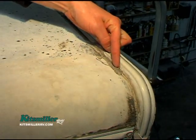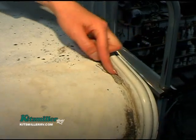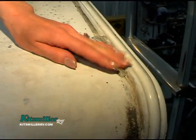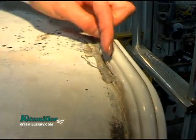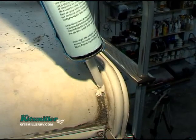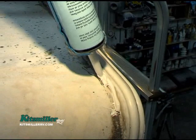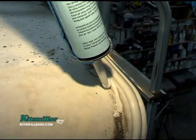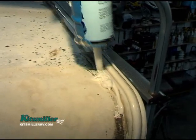We're going to trace along the lines with our fingers. If we can get a fingernail into any one of the cracks or gaps, those are places that we want to seal. If we have sealant pulling away from the moldings, those are places we want to seal. You really don't have to be careful when you lay the sealant down — you can glop it on as much as you want, it can be ugly, nobody's going to check your work. It's actually a self-leveling lap sealant, so it's going to lay down over the cracks and fill in those gaps.